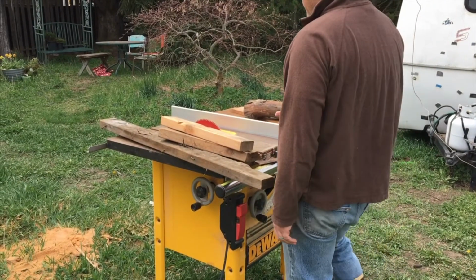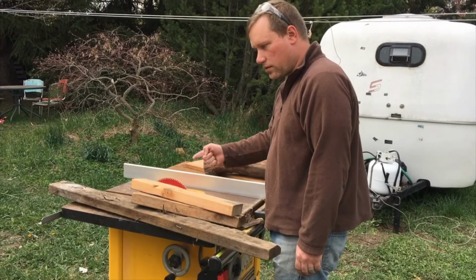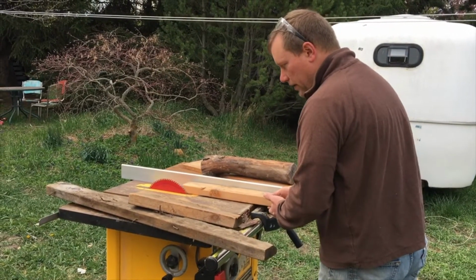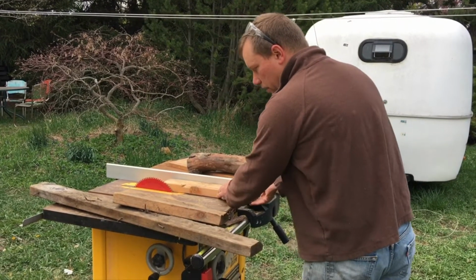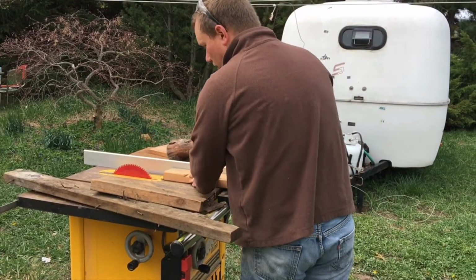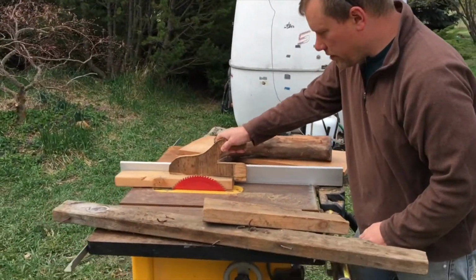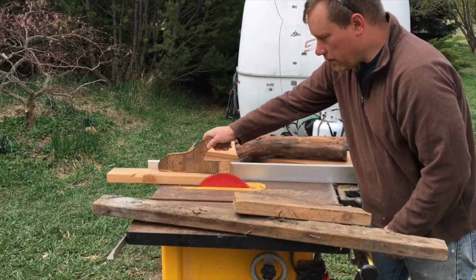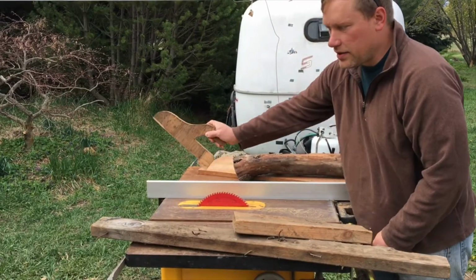Just like that. We have a blade, and of course the rotation is towards you, which is a key thing to talk about with pieces of wood that might get stuck in between the blade, and if they're not being held securely, could fly out. That's why you would never want to stand directly behind the saw. Also why you want to use a pusher, and actually not just release the material once it is done being cut, you want to make sure that material is clear of the saw. Okay, and you know what, if you have to toss it, that's fine.